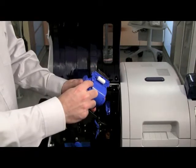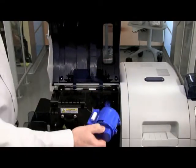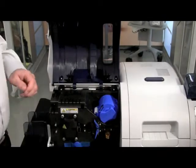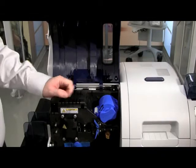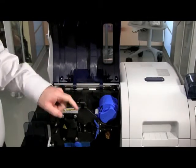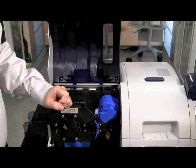If the laminate is protruding, use the thumb wheel to pull it back so it is not protruding from the lip. To load the laminate cassette, take the cassette and slide it onto the spindle. Then secure the laminate cassette to the latch — you will hear an audible click and see the latch engage. Once you hear that and see the latch is in position, your laminate cassette is successfully installed.